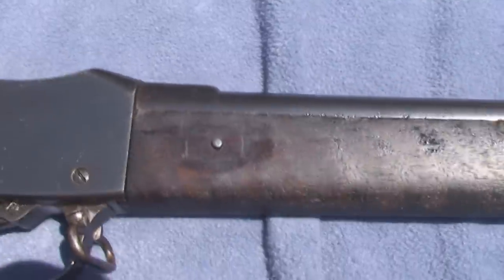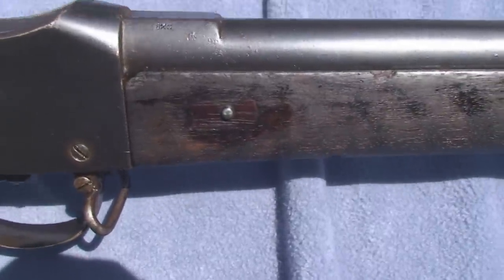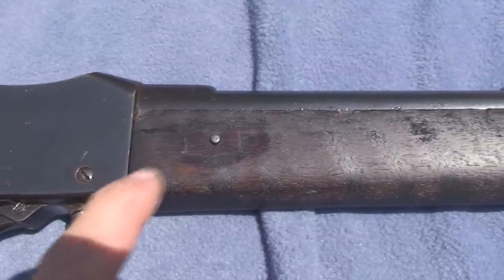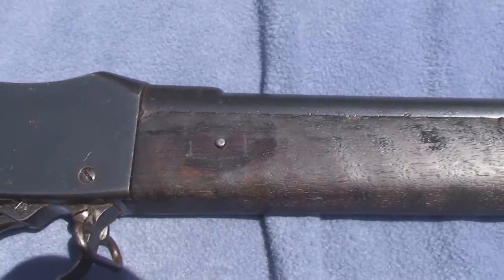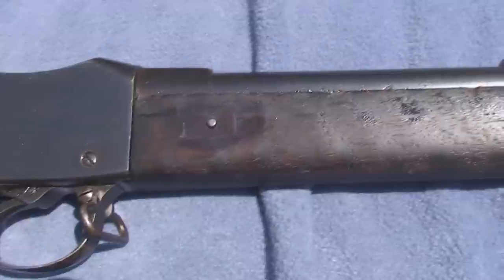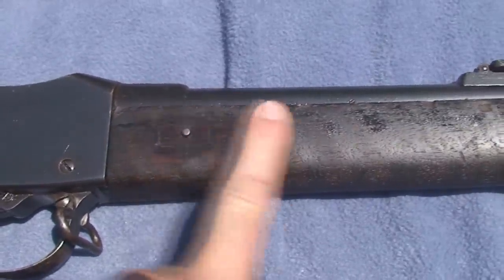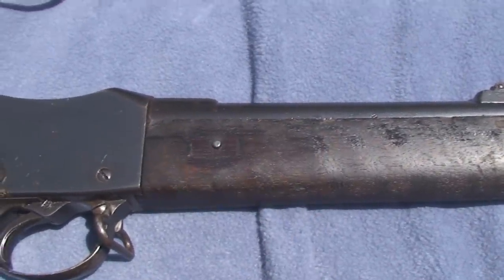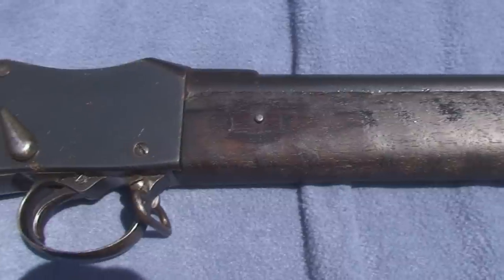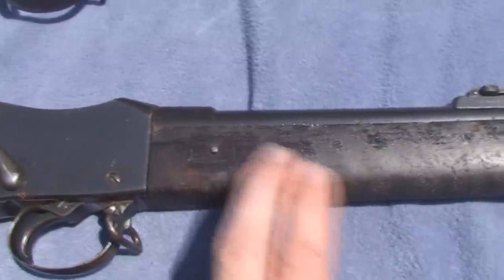The chromium trioxide that I got from Brownells did a really good job of darkening the white oak up a bit. After I used the chromium trioxide on it, I put some black walnut stain on it. It darkened it up even more and it pretty well matches the rest of the wood around it. It's a little shiny in this area — perhaps that's from where I stained it; the stain got on that wood and not on the others.